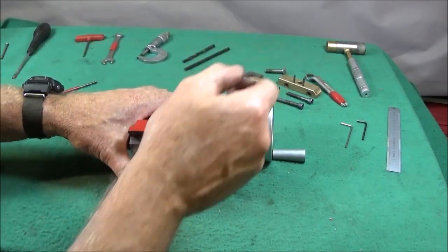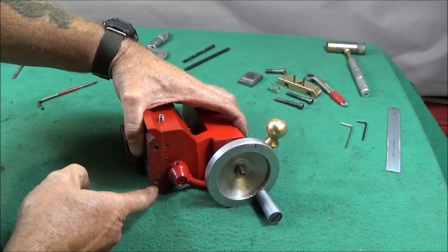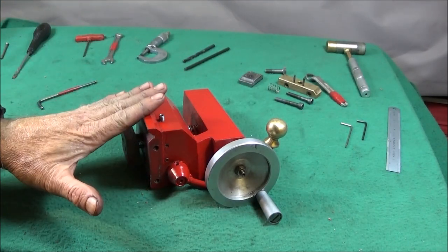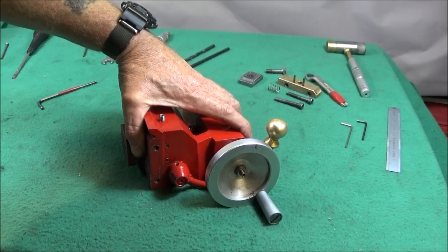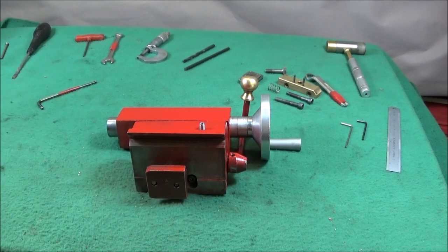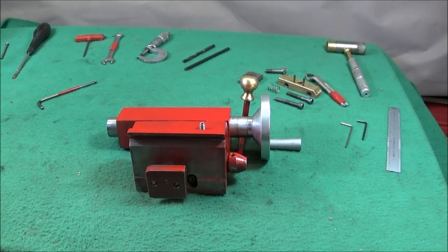It's a simple device — very little change done to the tailstock, just a couple of threaded bolt holes — and it's easy to make and set up. That one will actually lock this assembly rock solid and you won't have any problem with the tailstock pushing back in the future. So look out for part 2.